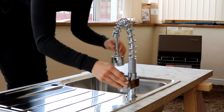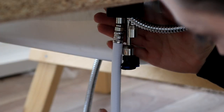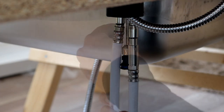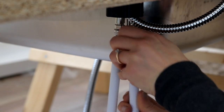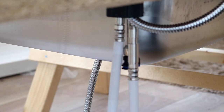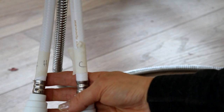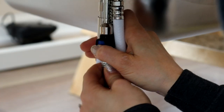But before I tighten it completely, I made sure I lined up the tap pulley onto the right side. Getting back to the different attachments on the hose tails, I found it easier to fit the shortest one first and then the longest one. Then I'm just nipping them tight slightly by a few millimetres with a pair of pliers. I also thought it was a good idea to label them hot and cold now. The long pulley piece just pushed and clipped into place, and it also comes with a heavy weight.